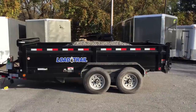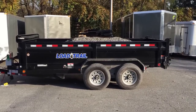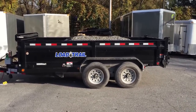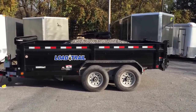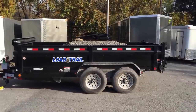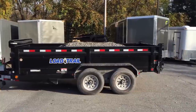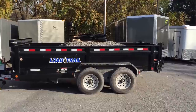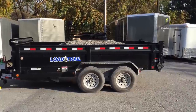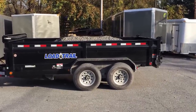This is Greg at Best Choice Trailers, Carlisle, Pennsylvania. Just a few minutes ago we showed you the Load Trail DT14 dump the way the load came off the payloader — a little bit tongue heavy. The trailer did in fact lift the load: it's a 14,000 pound load, about 2,000 pounds over the legal payload of the trailer. We wanted to show you that even if you're a little bit tongue heavy, this particular dump based on the pressure and the hoist should have no problem picking up the load.